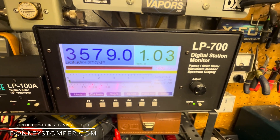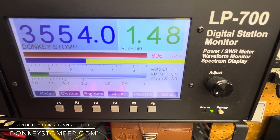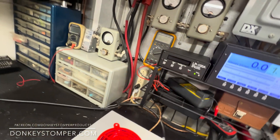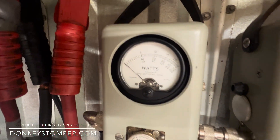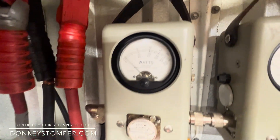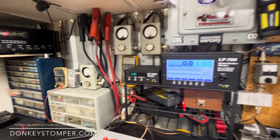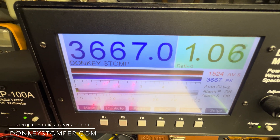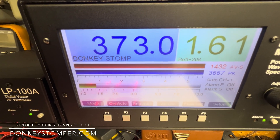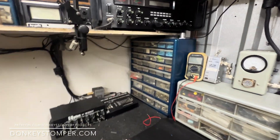Driver on the low stage. We're in the low stage now — we'll hit it with a little more power. This is driving to about 432 to 435 peak drive, which is plenty. Some people drive them harder but I wouldn't recommend it. That's good numbers.